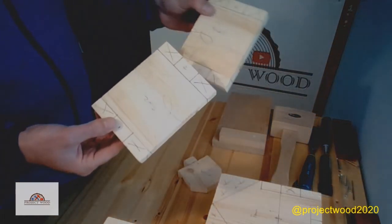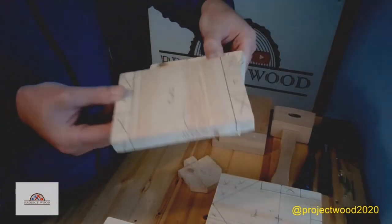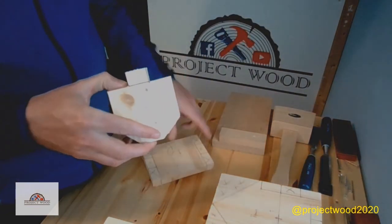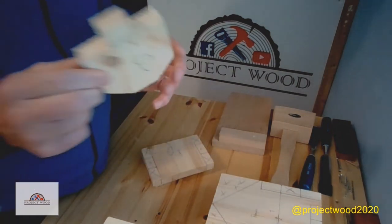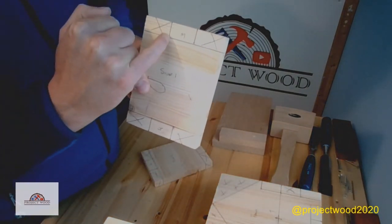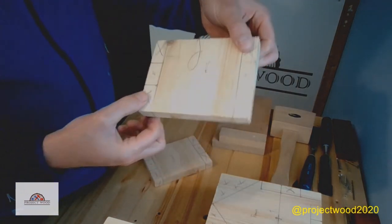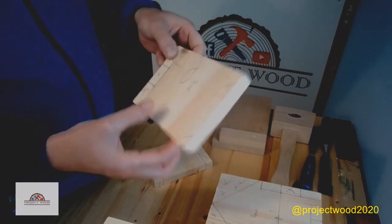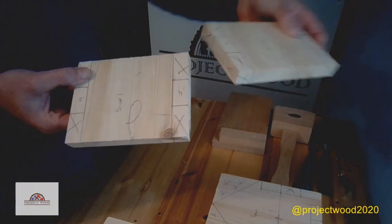Now we'll work on the two side pieces of the bird box itself. So there are 8 pieces to remove here altogether. And we've been practicing those already because they're the exact same as how we removed the two shoulders for the front doorstep piece. So it's the same process again. We're going to saw down on the waste side of the line and the waste side here, and remove all 8 pieces. So I'll go through the cutting out of one of these, and you just repeat that then for your other 7 pieces of waste to be removed.